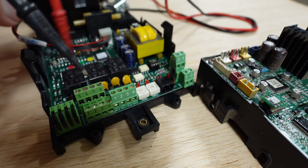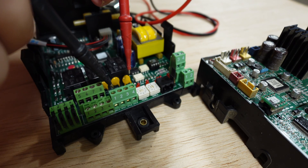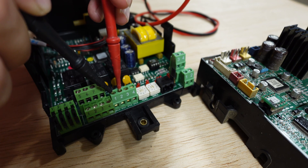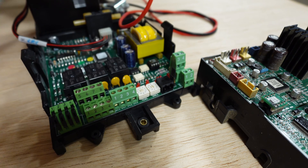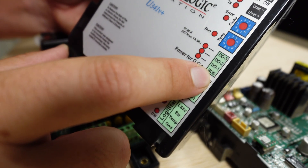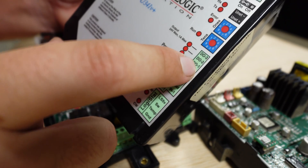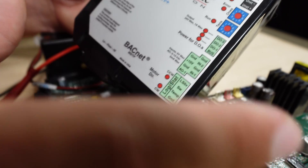To troubleshoot a digital output it's going to be very similar to troubleshooting any kind of relay. Most terminal strips are going to have a common bus — on this one it's this terminal here, and then I have three output points, so I can register across any of these to get my reading. Typically a zero reading indicates the relay is closed and passing power through. You would run a jumper from your 24-volt feed down to the bus terminal and then feed a set of relays activating something downstream like a contactor. Keep in mind, with all of these components they are soldered to these boards — they're not meant to be serviceable and you're not going to replace them the vast majority of the time.